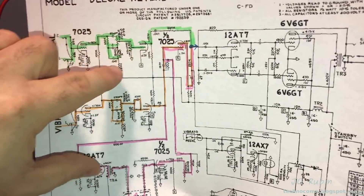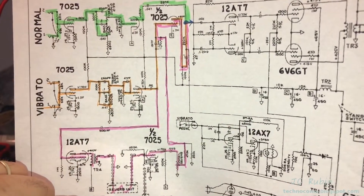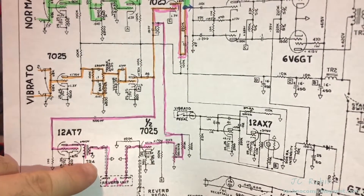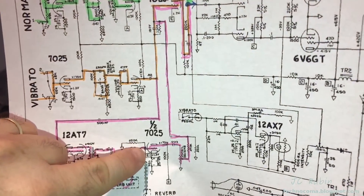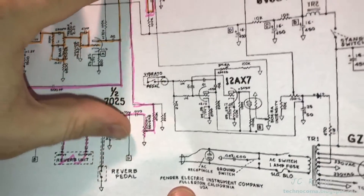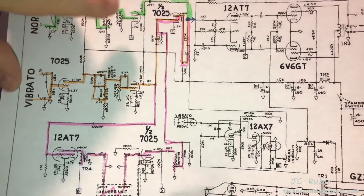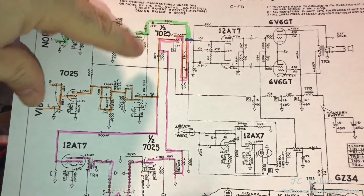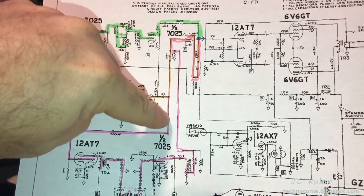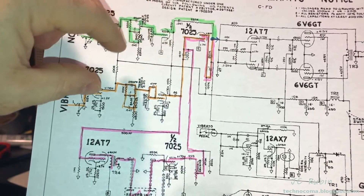When I was testing and saw this problem, I had turned reverb all the way down with the switch in the closed position. That closed position takes this signal to the grid and pushes it to ground, so there's essentially no wet signal coming through. Essentially all you're really getting is a signal here, which limits it to this section — and any signal that comes to this is just a product of this one anyway, because it splits off right here. That limits troubleshooting down to this area.